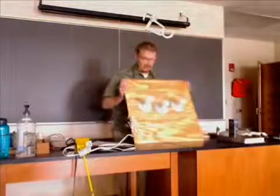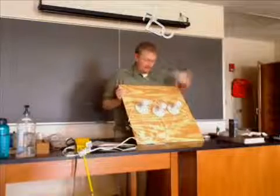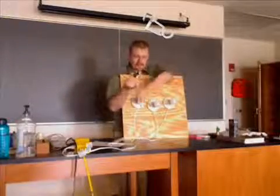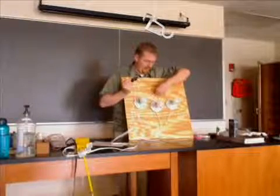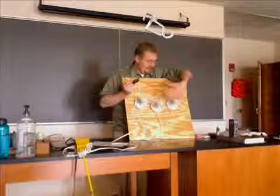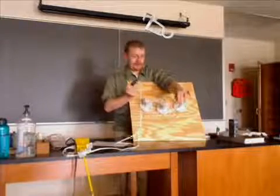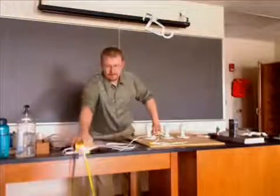So this is our last demonstration here. We have three light bulbs hooked up in what we'll call a parallel circuit. We have three different branches out of the power supply. We have a switch here with one cord that's going to break off the top of the circuit, go to the wire nut and break up into three separate paths and go through the three light bulbs. They're going to reconvene at the other wire nut heading back into the power supply and then back into the power company.